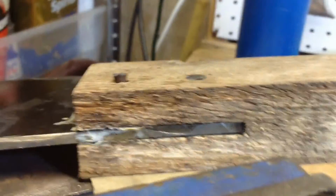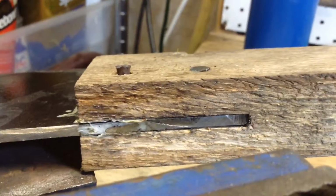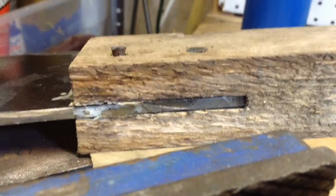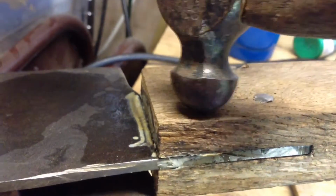So I'm using the rivets that we just made, and you can peen them down as rivets. I'm making a cleaver for my aunt. I drilled a hole that fits that measure of stock through both, like you do a rivet, through the wood and the steel, and then I'm just peening it with the ball peen hammer. So I'm hitting the peen against it.